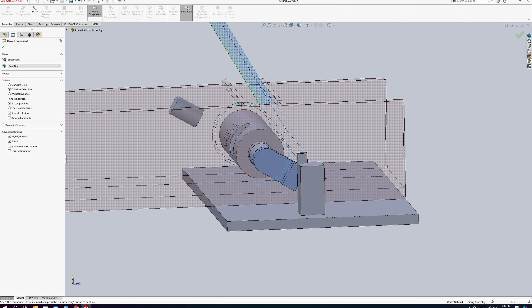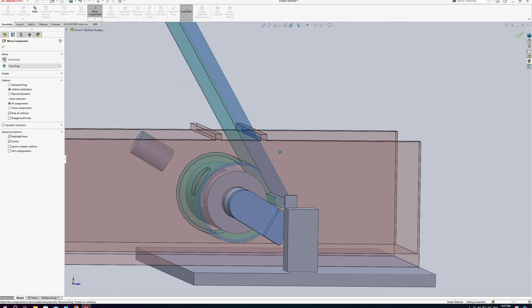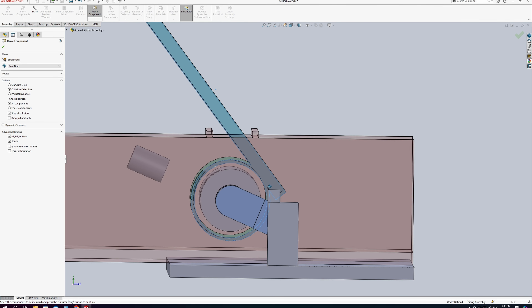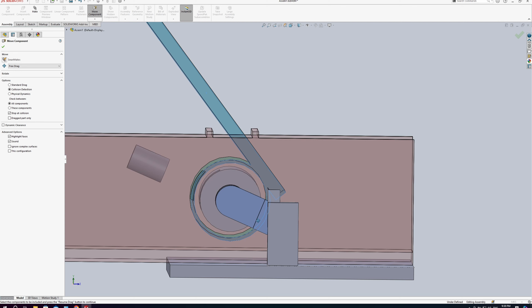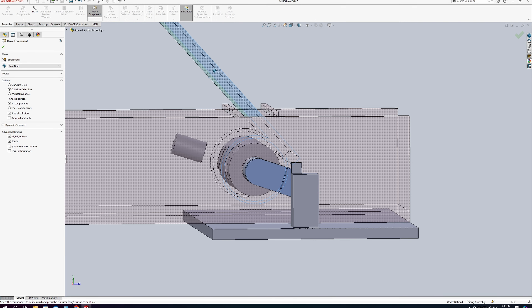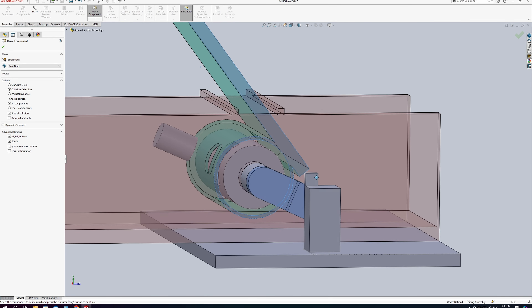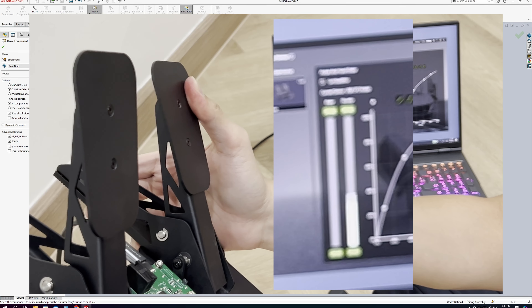When you start pressing all the way, the magnet ends up here but the hall effect sensor is here. The problem is that when the pedal is in the natural resting position, sometimes from the factory the magnet is too far from the hall effect sensor, so it won't pick up the signal until you press down to about this area. That's why this pedal has a lot of dead zone. And because the magnet starts so far away, the resolution from the hall effect sensor is quite low — really low, as you can see in this clip.